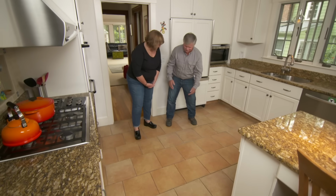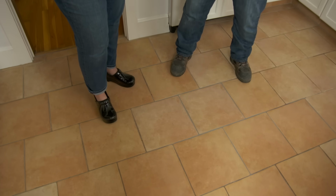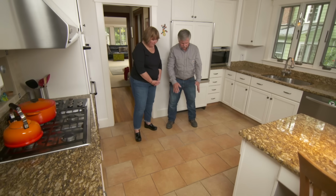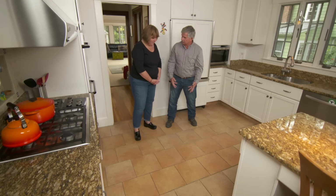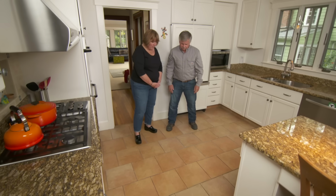All right, Kate, we broke out the broken tile and we replaced it with a new one, or should I say a new old one. Yep. And grouted it all in there. Looks fantastic. Okay, so now this grout's going to take about 24 hours for it to really set up. So I would really like it if you could put a chair over here for tonight or something just to keep somebody from walking on it. Okay. Keep two little kids from walking on it. Exactly.